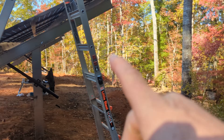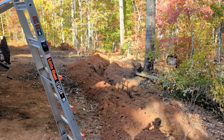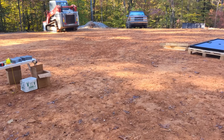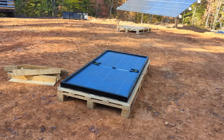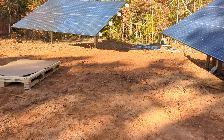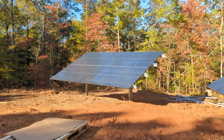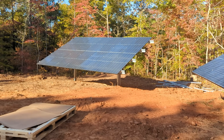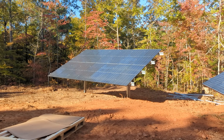Beginning the trenching — we've got 600 feet of an AC run up to a future building. I've got an intersection now with that and our solar conduit: two-inch conduit, direct bury four-aught. We're going to throw a PEX line in there so it'll have water up to the garden area. Two extra panels will go in the shipping container — that's in case there's any damage in the future. It's nice to have extras for tree branches, accidents, sometimes even on purpose. I'm happy with that layout; with all deciduous trees here the leaves are coming down and it's going to do really well.